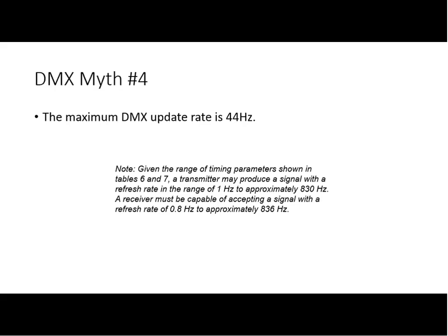So, Eric, do you have something? Yeah, where this does end up being done is when you're using things like strobe lights, with human perception being on the order of small tens of milliseconds, and you want to make sure that you're able to do faster flash sequences. You'll see them sending shorter packets more frequently to be able to do tighter sequencing of strobe sequences. I've also seen it done to get higher refresh rate on LEDs that are synced to higher frequency video. Yep, absolutely. Cool. So I think we have a little better understanding of update rates.